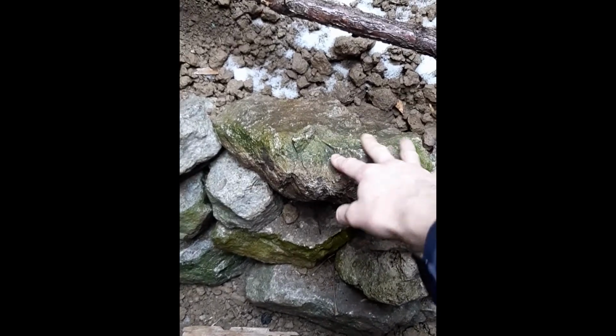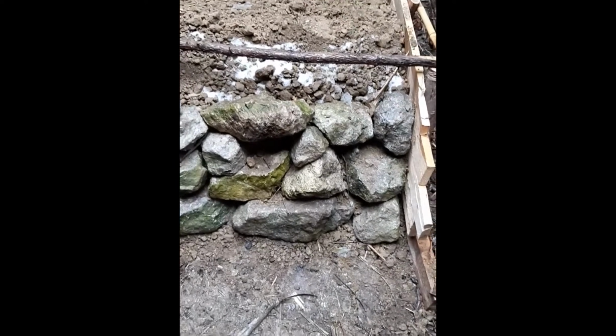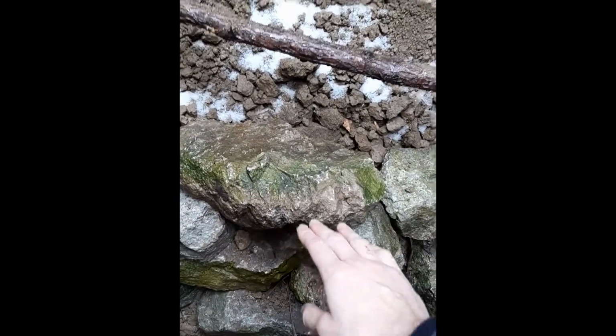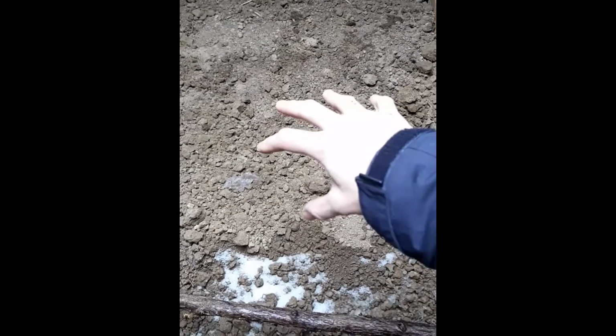Going back to radiant heat, the radiant heat is going to be stored as that smoke goes through the chimney channel, through this whole mass of clay and out the end, which I just showed you. That heat is going to be absorbed by this mass right here, which is a sort of bed you can lie on. In a conventional stove, all the heat in the smoke would simply go out the top of the chimney and be wasted. But here the chimney of the stove is actually this mass, and the mass delays the smoke long enough as it goes through this channel that the heat has more time to spread out into the mass.